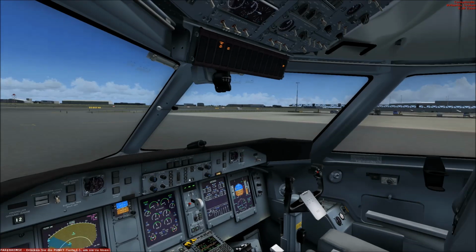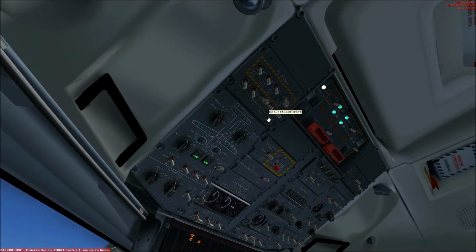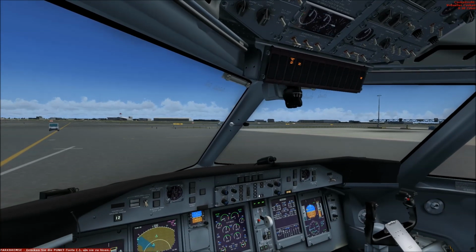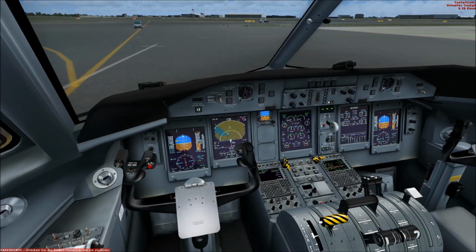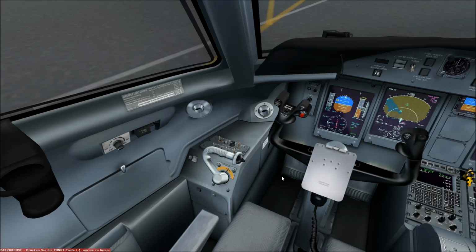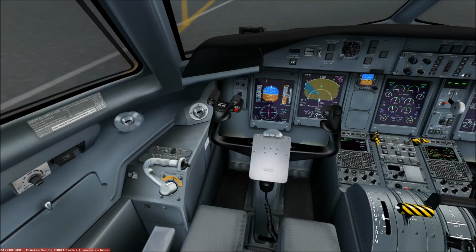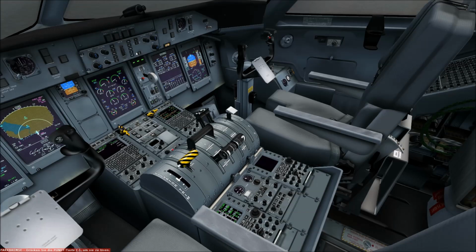So external power APU is off. Main bus tie is off. Ice protection is not on. Rudder travel is full travel. Rudder actuated test is completed. Nose steering is on. Auto feather is selected. Engine rating is checked. Batteries are checked. Flaps are 5, set, checked.